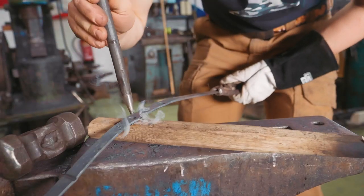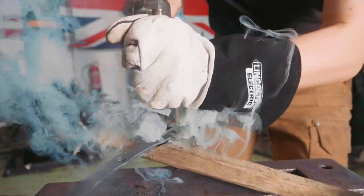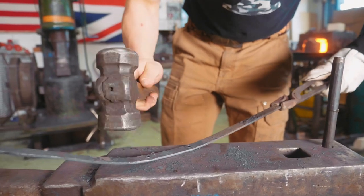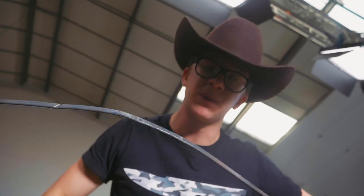Here's another interesting technique for popping out a little hole if it's too weak to come in from the backside: you go over a piece of wood through your countersunk hole with your small punch. The tiny little plug ends up in the hardwood and you end up with a rather very clean hole. I couldn't come into the backside because this material would have caved in, so we go over that piece of hardwood — it supports it lovelily. We're now ready to cut this off.